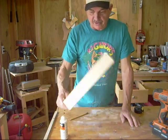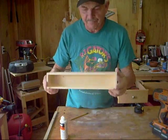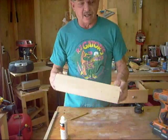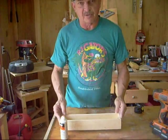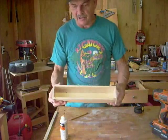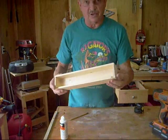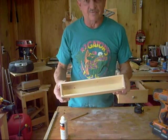Now, another thing before I finish here, before I forget: you can paint it or not paint it. I recommend a good spray finish. You can get a spray stain or a mixture stain-urethane type of spray. They sell that now. Give it a shot, and screw your things in so you don't get them coated. And you're done. You can match up your kitchen cabinets if you want.